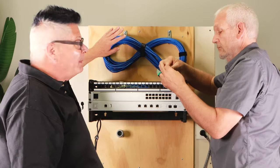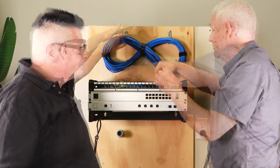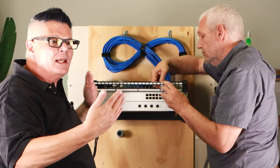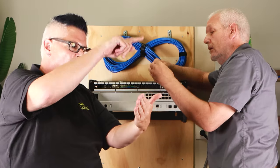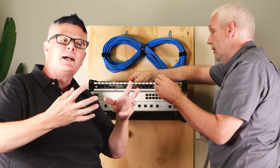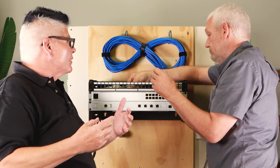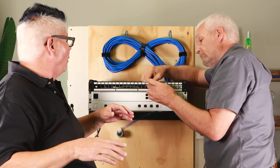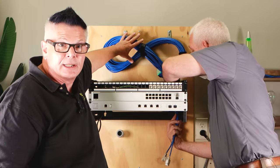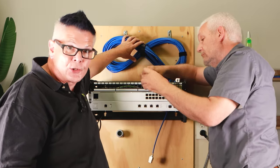You may wonder why it's turned into a figure-8 pattern. If this were unshielded ethernet cable, you want to store it in a figure-8 because that minimizes interference — you've got the cable laying back across itself in different directions, which minimizes cable interference and also minimizes the possibility of the cable picking up radio frequency interference. So with unshielded cable you do not want to coil it into a circle. This happens to be shielded cable, so doing the figure-8 was a little overkill — we could have gone with a circle in this case.